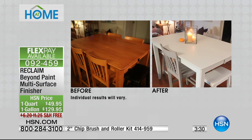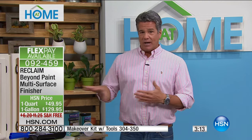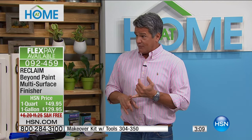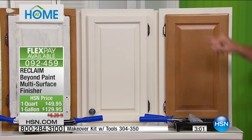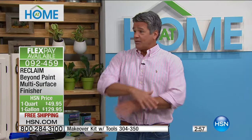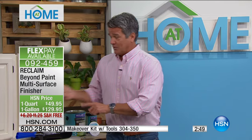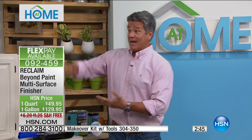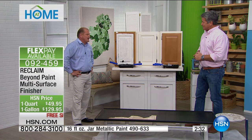This is a special product. Everybody has tried their hand at do-it-yourself projects with paint. When you look at the prices here, you have to remember how many steps you've eliminated and how many products you don't have to buy. If you were going to do a cabinet with regular paint, you'd need a stripping agent, you'd sand it, you'd vacuum the dust everywhere, wipe it all down, prime it, maybe two coats, then a finishing coat. You would spend three times the amount of money. With one quart you can do 15 cabinets. Get a gallon, do a nice-size kitchen — no brush marks, no roller marks.